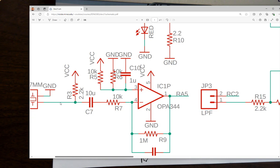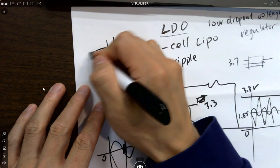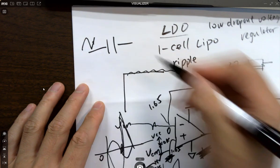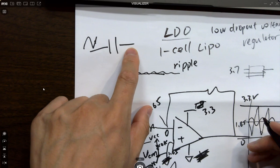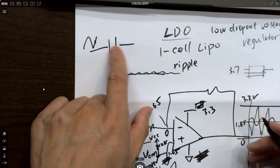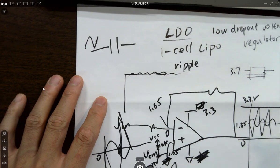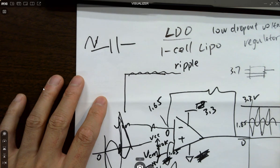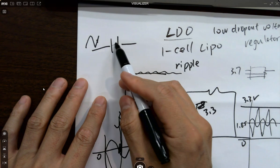AC. So the capacitor is the AC short circuit. Okay? A capacitor can pass AC. Do you know why? Have you thought about why an AC signal can pass? It's a disconnected circuit. Is it really passing? No. What is actually happening? Just low impedance. No. It's like drawing current back and forth, drawing charge. No current is really running in here, right?